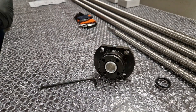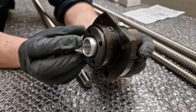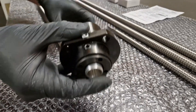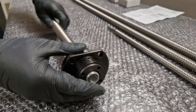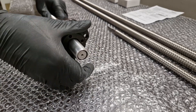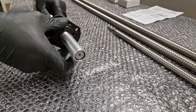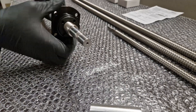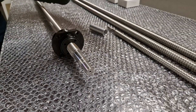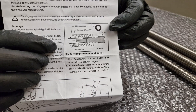The next step is to assemble this onto the ball screw itself. Pay attention to the bushing installed inside the ball screw nut — there is a turn feature on one side, and this turn feature has to point away from the fixed bearing side of the ball screw. Then slide it onto the machine surface, slide the ball screw nut until you feel resistance, and start turning counterclockwise. I really like this system because Easel gives you plenty of adjustability, and I can't wait to get my machine finished and see how these components perform.